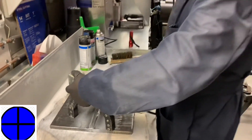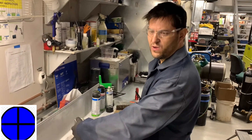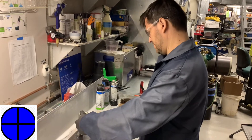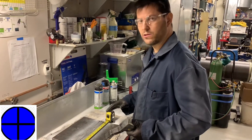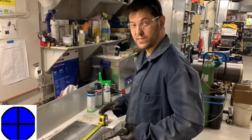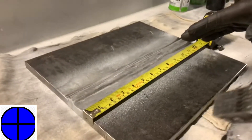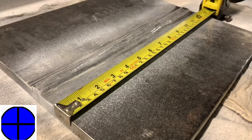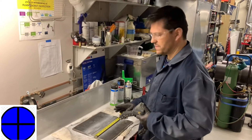Blowing always helps in this process. You could also tilt it with gravity and have it drain for you — that helps too. So we've magged both directions now, doing a perpendicular pass looking for defects going in all directions, which we did note. Put tape on it. We made sure when we noted it in our results and report that we have it marked at the exact locations. It's very important — if there are any repairs, they need to know where to fix them.